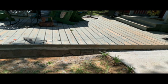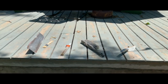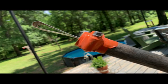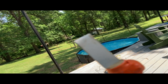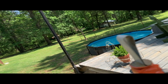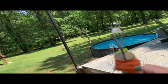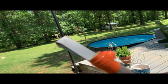Okay, so here we go again. We're gonna try to see if we can make this work. Just so you know, this is what I use to put my mortar lines in, and that's nothing more than a piece of tin about 3/4 inch wide. You bend it in a U-shape. I took a hacksaw, cut this piece of a broomstick. I cut a slot in it, slid that in, and put a hose clamp around it. It works great. That's what Mr. Klesnikoff uses, and it works fine.